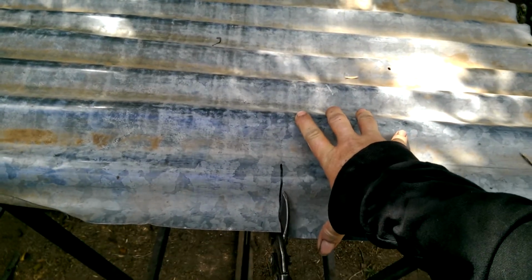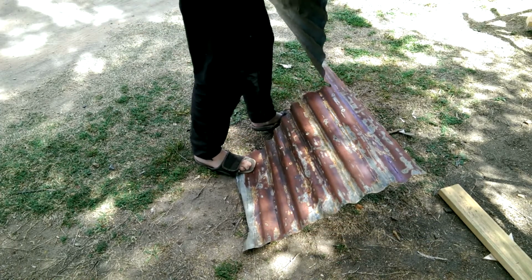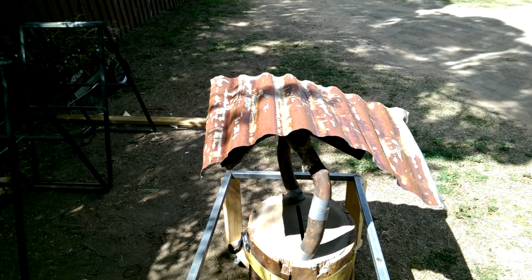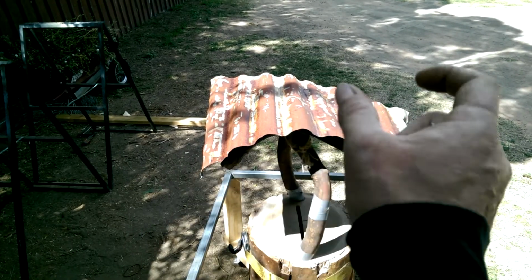Go and grab the tin snips. This stuff is super thin and super easy to cut, but I'm going to show you a trick in a minute. Alright, we got that started. Done! Alright, now that I've cut that down, or torn that down as it were, I'm just going to throw 2 screws in it just to locate it and hold it in position. I'm going to put those 2 locators right at the top. Well, not right at the top, offset, but at the top.